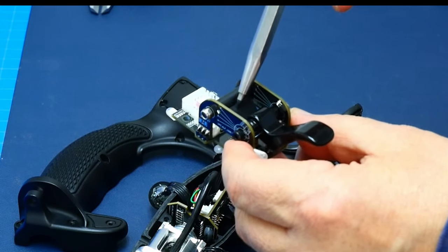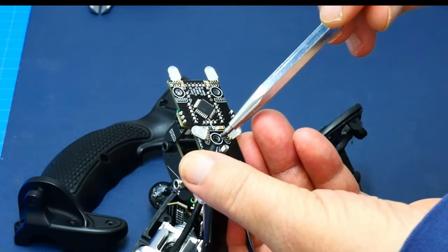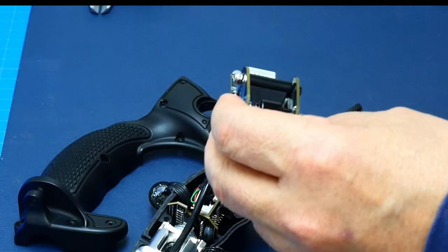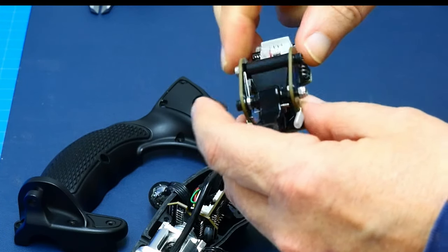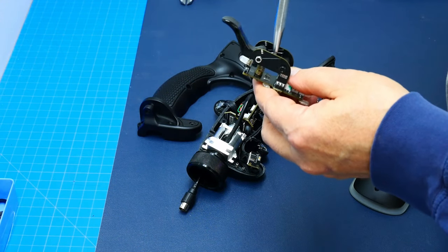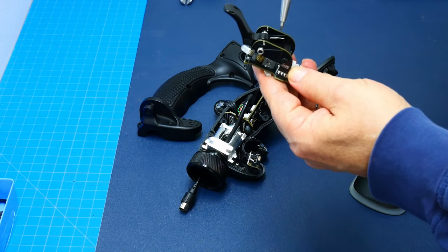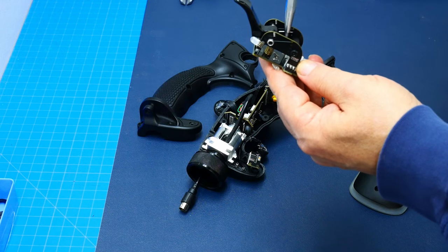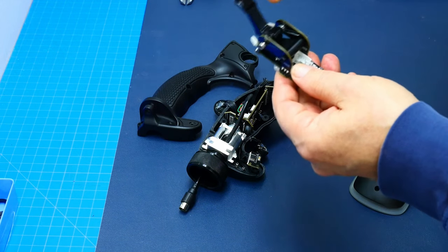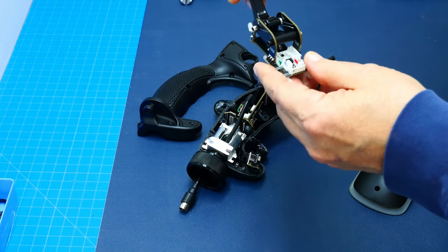You cannot use a key to tighten it, and all that would be needed is a little hole which would not affect structural integrity. So I'm going to drill a small, probably one-eighth inch hole in here to get a key in so I can tighten this up without having to remove the whole assembly with the spring loads and everything to get this done.